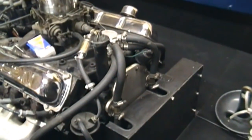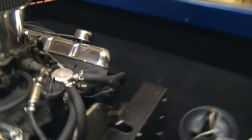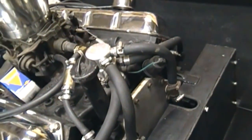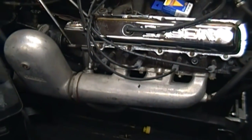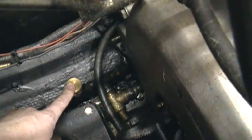You're probably asking yourself, where's the water pump? There's a tap on the bowl — it's kind of hard to see. Water comes through this valve up to the engine. This funny-looking thing is actually a thermostat housing for marine application. A lot of people cheap out and don't get this and try to control the temperature with the valve back there, and that's a really bad thing to do because it can basically overheat the top half of your engine. The purpose of this device is to make sure that your water-cooled exhaust manifolds always have water flow.